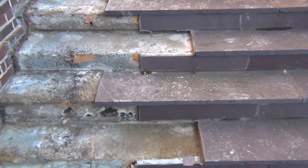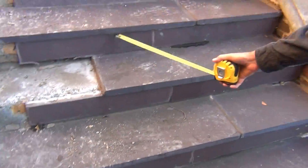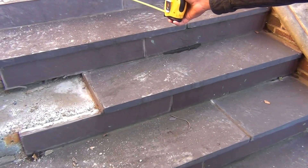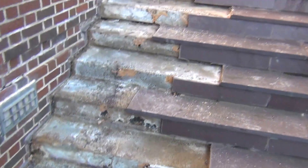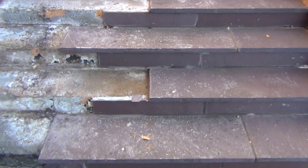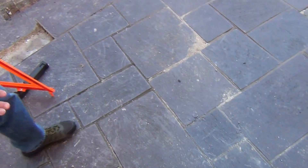The only thing I can do is add to the mortar joint of the bed, but I can't make that a one-inch thickness and this a half-inch thickness — it all needs to be equal. I think if they've got to tear that out, they're probably going to have to tear these steps out too. Then you can put them at whatever level you want, lay it out perfectly, and that might work this out where you don't have to.